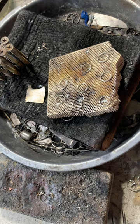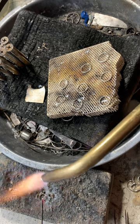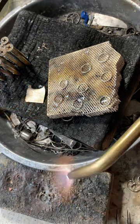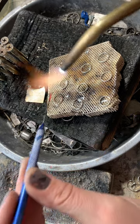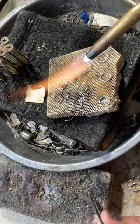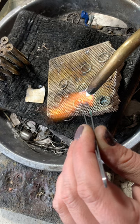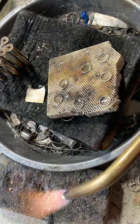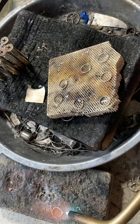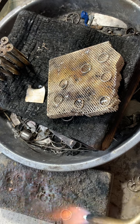If you're not using honeycomb to solder on, you could just take tweezers and put it directly on it. I can show you guys that too for the people that don't have a little soldering pick. Another way you can do it is having it on just a round surface, taking it and just putting it up against it — that'll make it flow to it too. It does have to be touching whatever it's going to be soldering to. That one kind of went to one side and not to the other side.